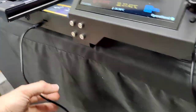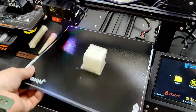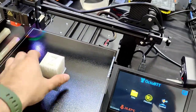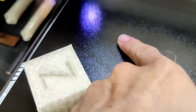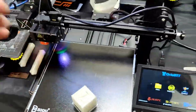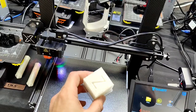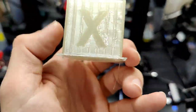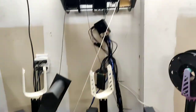So what I had to do was add one more cable and plug it into the front of the printer. Now I've got full control. I got my first test print off of it. Look at that - very nice! I even smashed the bed a little bit. That's the amount of damage it'll do if you run it into the bed - I've already cut through the surface. I did an auto bed leveling but I didn't adjust the distance of the nozzle, so that's what did that. Definitely do your auto bed leveling and adjust your nozzle distance.